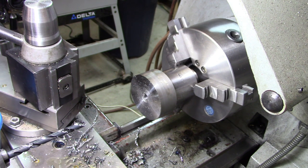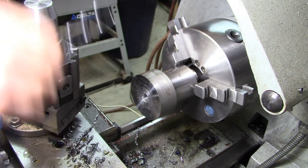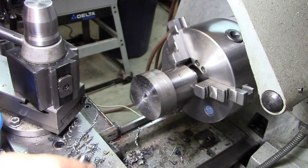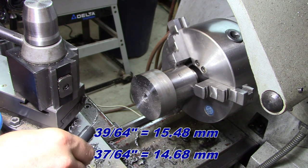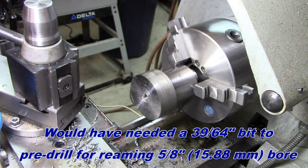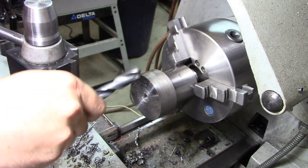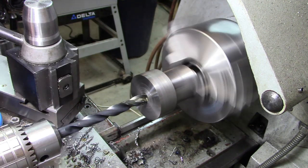There's no real reason to have to make this a through hole — the part itself is just under two inches long — and the hole is now drilled two and a half inches deep. As far as drilling goes, I don't have a 39/64ths drill bit; I do have a 37/64ths, but not a 39/64ths, so we're going to use that to start with. Let's do 220 RPM and see how it likes it.